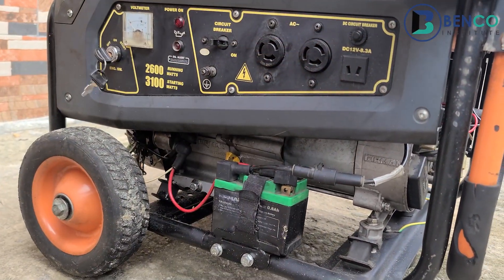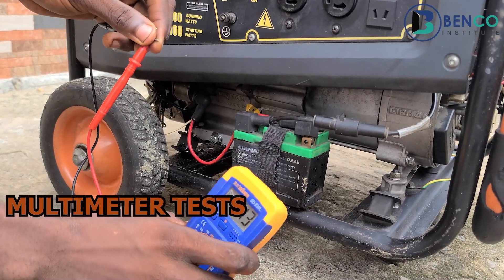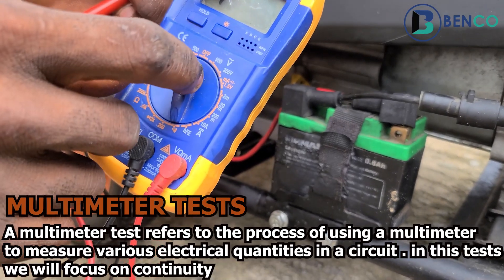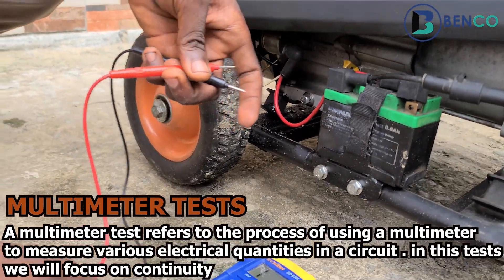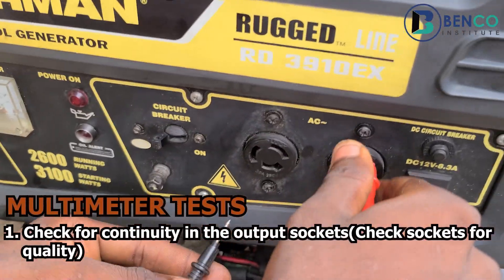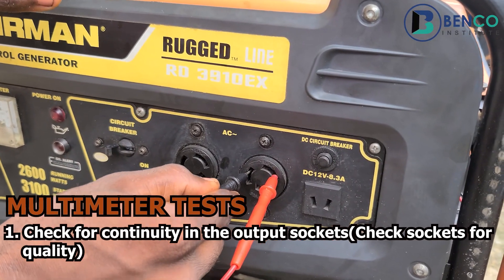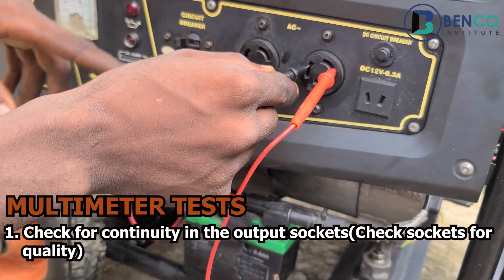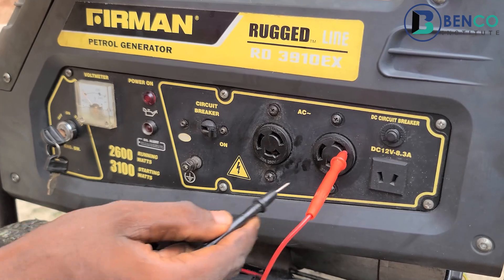Number two test — this time not visually but with a multimeter. What I do is use the multimeter and test for continuity. I move the dial from the off position down to the continuity position. You can then insert one probe at one end and another probe at the other end. You may notice at first there is no reading — no continuity indicated. But notice that the circuit breaker is in the off position, so move it to the on position. This time it tests for continuity.